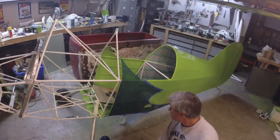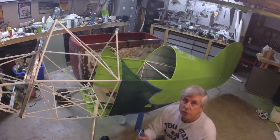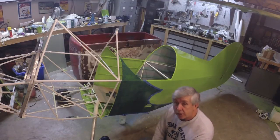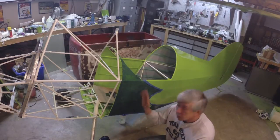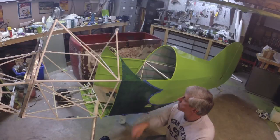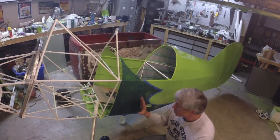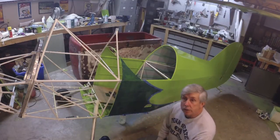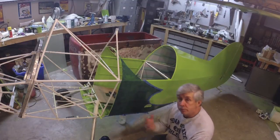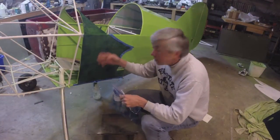We just use a smooth-surface foam roller with the paint thinned down about 25% with water. Thinning it helps it flow a little more and removes some of the orange peel — though it will still leave some orange peel, more so than if we had sprayed. Spray will leave a smoother surface and takes less finishing work, but with rolling there's less masking work. There's your trade-off. We're going to put a few more coats on this and see what it looks like.